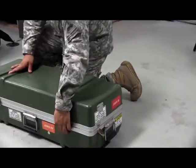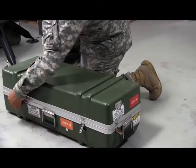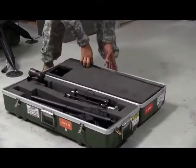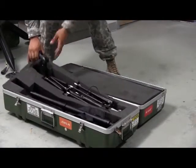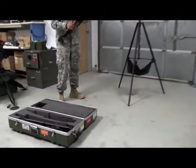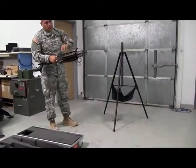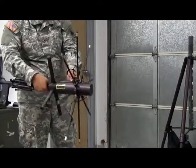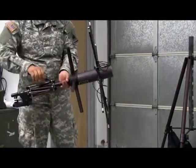The SATCOM antenna ships in a different looking type of transit case, and there aren't any pressure relief valves, so just undo the clips and open it up. Remove the main section of the SATCOM antenna and start extending the signal receiver poles from the center of the unit. They will lock into position. Make sure you extend every single one.